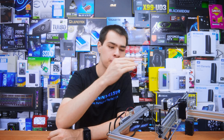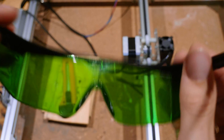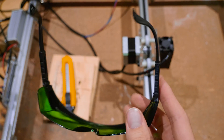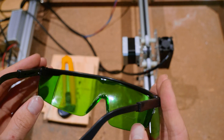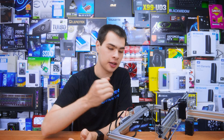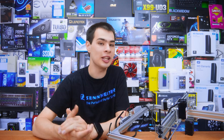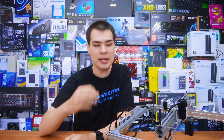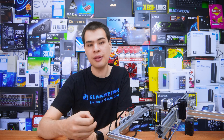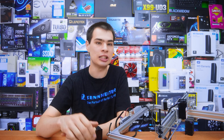The laser itself works just fine, and whilst the glasses that come with these units are okay, if you are planning to use these laser engravers with the cheapo eBay glasses — don't. Go buy something that's legitimately decent and rated for the wavelengths of these lasers, and that will protect your eyes much better. The little green ones that come with these will get you by, but they're nothing really great. Once you're blind, you're kind of blind, and lasers and eyes don't mix well. When it comes to burning basic shapes, it does the job just fine, but anything more than a basic circle or square really trips this thing up.